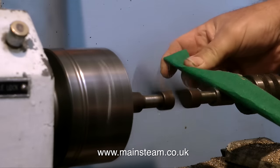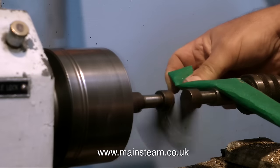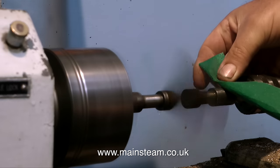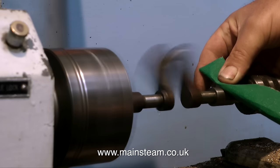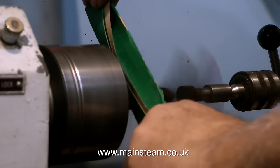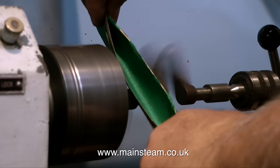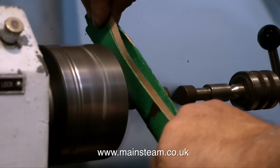What I thought I'd do is put the crankshaft in the lathe, check how true it was, and clean it up with some sandpaper. A quick note about cleaning things up in the lathe like this: I would try and avoid using the woven type of emery cloth, because if it catches up in the work, the woven type is very strong and may actually drag your fingers into the moving parts. This standard sandpaper, if it gets caught up, will just tear, leaving your fingers intact — hopefully.